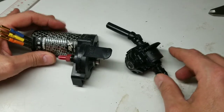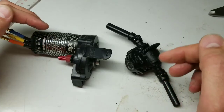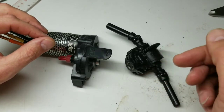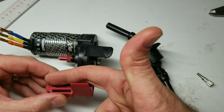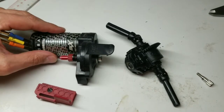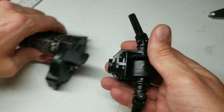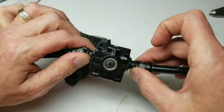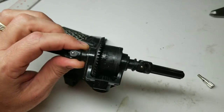From the instructions I've seen on Facebook and forums, this ought to be a pretty easy mod, so I figured I'd do this on video so that if somebody is a little timid about cutting into stuff, hopefully this will come off fairly easy. I'm starting with the diff and power module already out of the truck — not showing that on video because Arma has very good maintenance videos for tear-down, linked in the description. Basically you take three or four screws out of the bottom of the chassis, pop the drive shaft out, pull the motor module back, and the bulkhead clamshells open so you can pull the diff out. But I'm starting here because once you've got the diff in the yoke assembly, how do you get that apart? I haven't seen anything online about it, so that's what we're going over today.